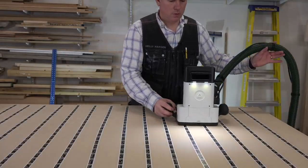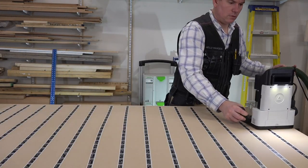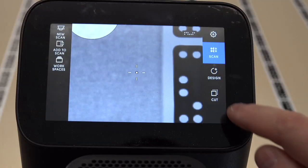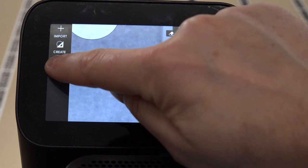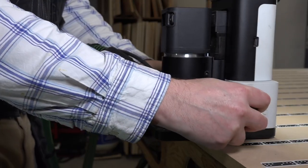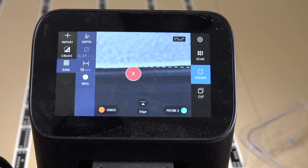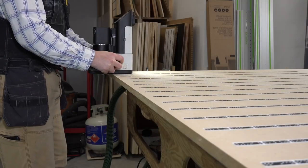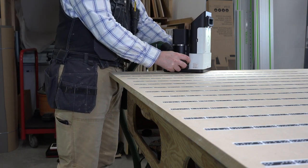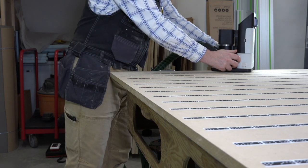Here I'm going to make a new scan of the Shaper tape field I've laid out. The Shaper has fiducial markers — each section has a unique set of dots that the Origin camera sees to track where it is in relation to the Shaper tape, much like how a GPS works by triangulating its position. Origin has a cool grid function which allows you to register the X and Y edges of a sheet of board you're cutting. I installed my engraving bit upside down to get an accurate quarter-inch pin to register with. You drop the pin below the surface and press it against the bottom edge of the MDF, probe a second point farther down the X axis, and finally probe a single point along the side to register the Y axis, which will be 90 degrees to the X axis.